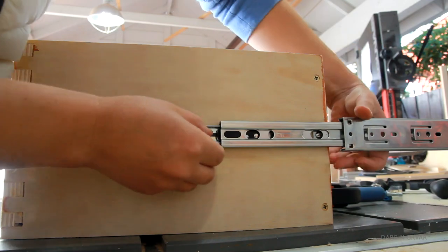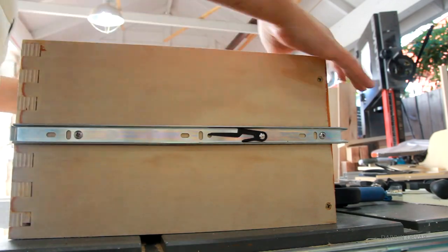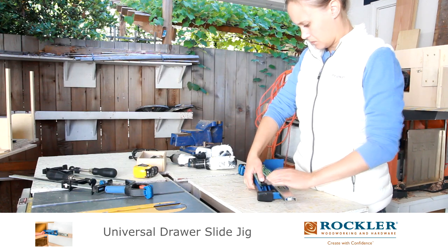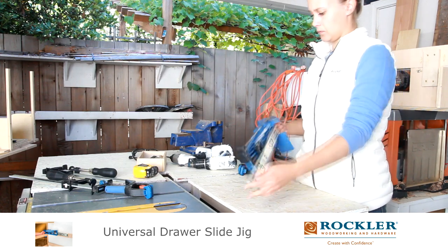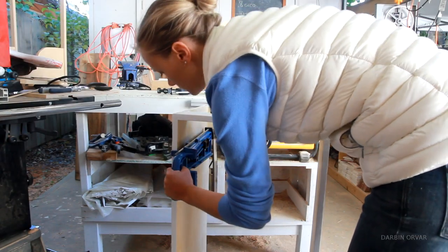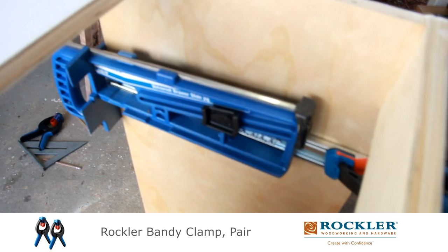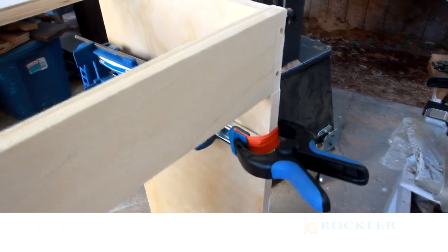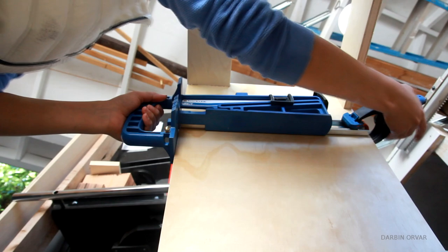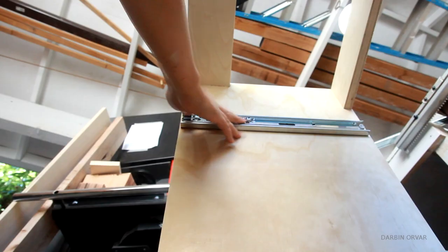Here you have a drawer with both parts of the slide on it, and then you can take off the piece that attaches to the base. I'm using this drawer slider jig to make it easier to align the sliders and get everything straight. You make a mark where you want the bottom of the sliders to go, follow that mark to set up the jig right, and then install it into the base. Doing it this way makes it a lot easier to line everything up and make sure everything is square. Then it's just a matter of repeating it on the other side.